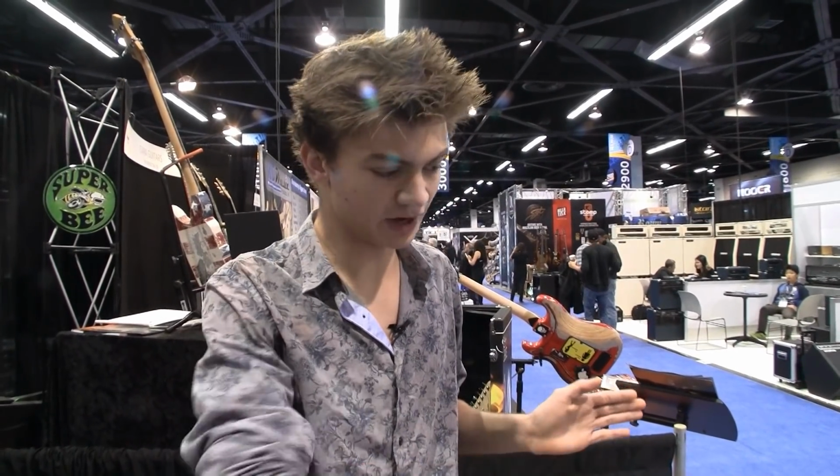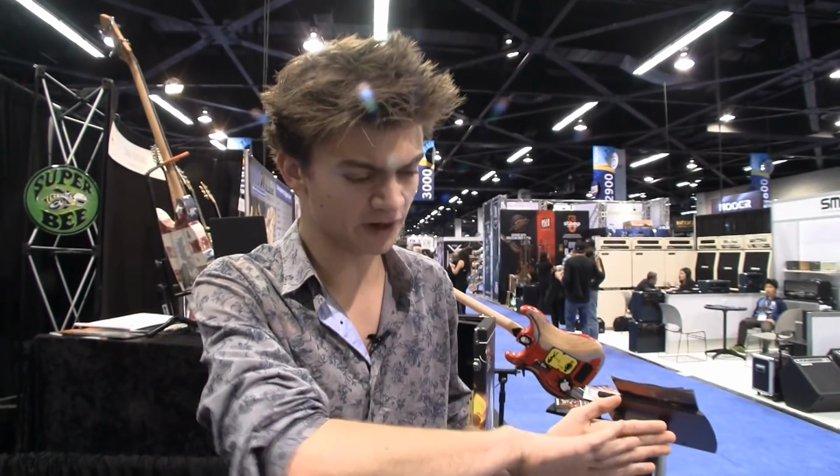You started this when you were like 15, right? Yeah, when I was 15, I basically told myself, not knowing much about this, I'm not going to stop until I have a working prototype. And this was all in my imagination at the time. But we would get circuit boards printed, a $200 circuit board printed, and then we'd put the parts on with tweezers, and we would reflow the solder on a $12 electric skillet. And it worked. It took 8 voice cards to get one that powered on, but here we are today with something that sounds just exactly like the original Oberheim stuff, to my ears anyway.